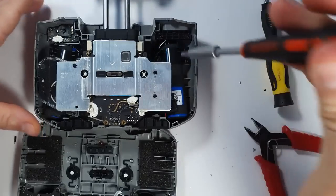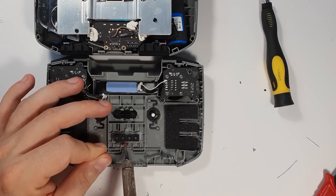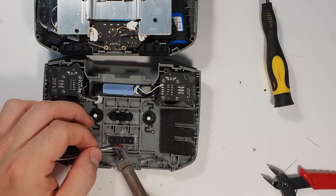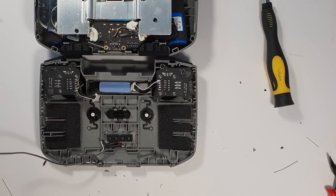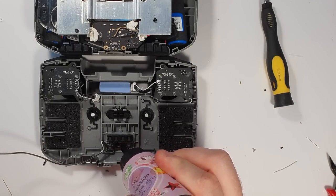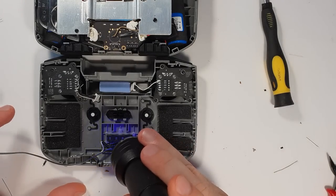When it's fixed in with super glue, I put back the heat sink with the four screws because now I have enough space to solder there. For the LED I used a 220 ohm resistor, heat-shrinked it, put on the other wire, then applied UV resin again and let it set with the UV lamp.